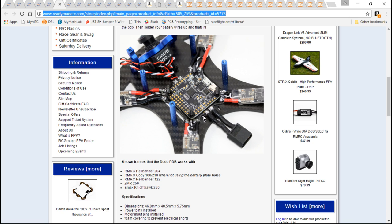The flight controller solders right on top of the PDB, and the PDB mounts right on top of the frame. It even has foam on the bottom side, which is basically soft mounting the PDB and flight controller. It's going to make a very low profile and very clean build — and I just love clean builds.